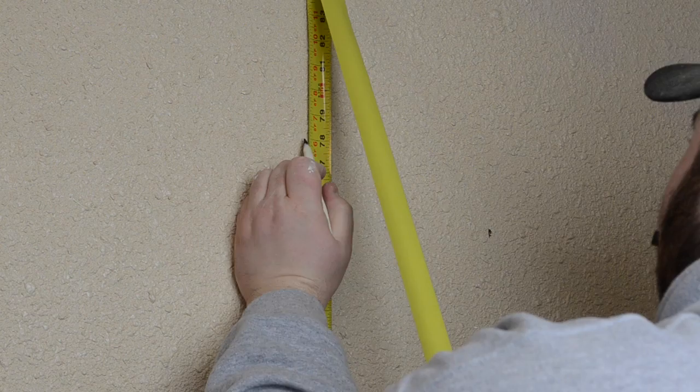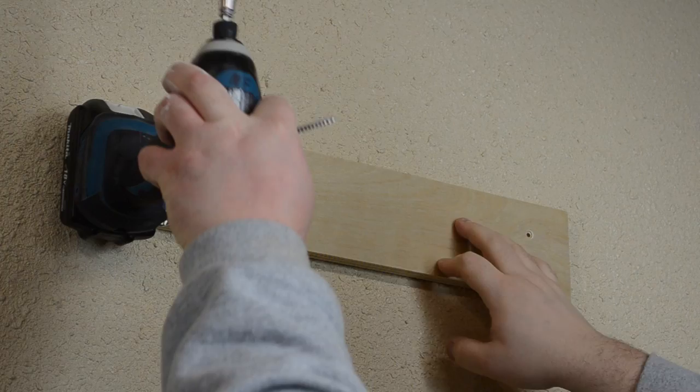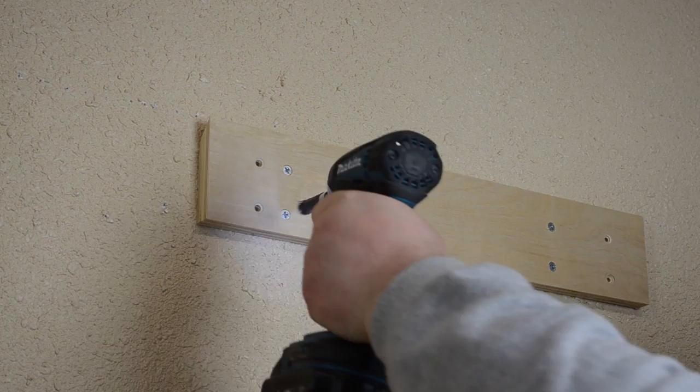This is the point where I thought it would be simplest to hang the French cleat portion to the wall. I found one of the studs in the wall, drove a screw, and then marked 16 inches over to try and find the remaining stud. Unfortunately, that second stud wanted to hide from every drill poke I put through the wall. Apparently the people that built my house were playing it fast and loose with 16 inches on center, because my tape measure showed the studs were 12 inches apart. With a cabinet this heavy, you definitely want to screw into the studs — I'm using 3-inch long screws. And yes, I own a stud finder. I just can't find it. Did they make a stud finder finder?